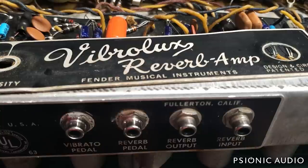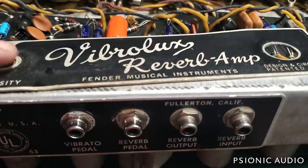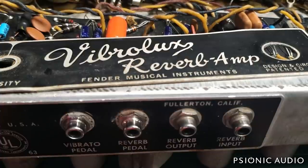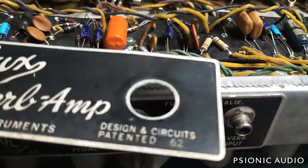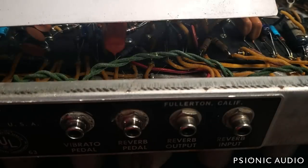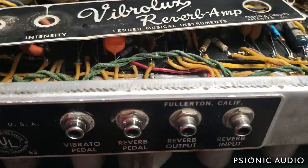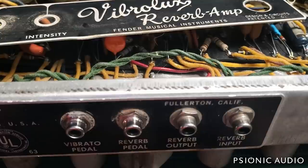I've got two sheets of flat steel. I put the faceplate between them with a little bit of paper towel protecting the finished surface from the steel plate. With some C-clamps I can clamp those steel plates together in targeted areas and make everything go much more flat again. This is very, very thin metal, and it usually comes out, if not perfect, a hell of a lot better. I'm going to clean it first, let it dry, then clamp it out, and we'll see where we're at.